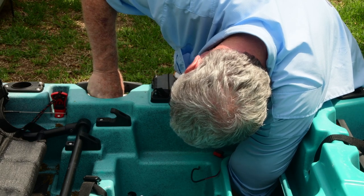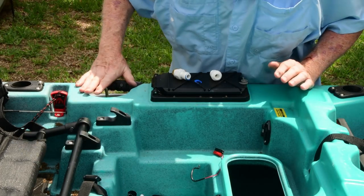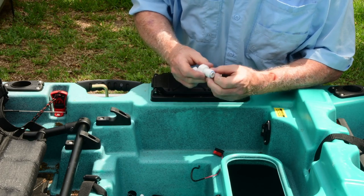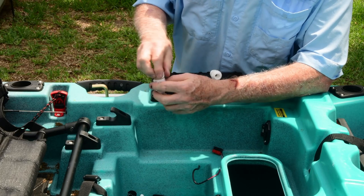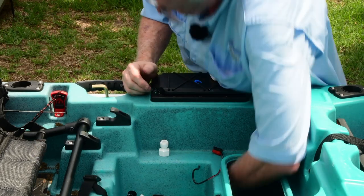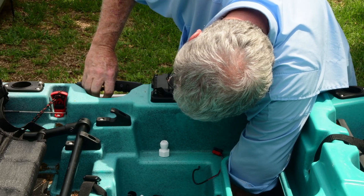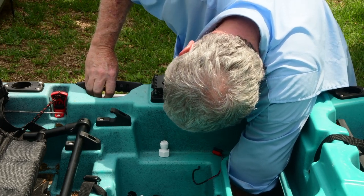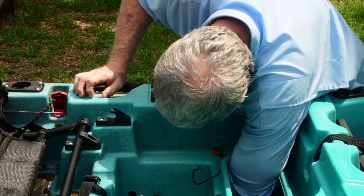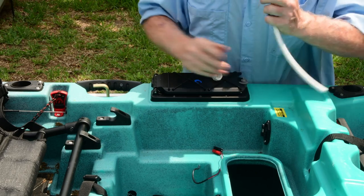Some of these are thicker than others, but as long as it's holding it in place without being super tight, that's fine. Next, take the reducer — I find it easier to hold it by the hex part and spin it on. Make sure you get a couple of rounds on it — one and a half to two rounds. This does not have to be super tight. Next, the adapter to go from pipe thread to tubing — that spins on just fine. I'm going to take the tubing, slide it up, and push it in place until I feel it snap. Once it's snapped in, I'm going to take one of these locks and put it in position.